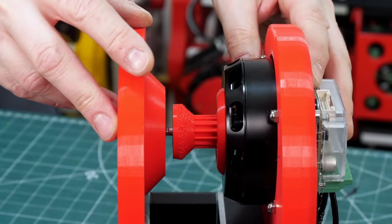The rest of the electronics for this project look like this, which is 4 BTS7960 motor drivers, which are going to control all of those linear actuators, a radio control receiver, and also a Teensy 4.1, and I've used that because it has CAN bus built into it. Though you do need the external CAN bus transceiver, which is that little extra board there, but that means we can daisy chain all of the O drives.